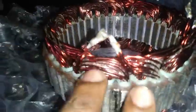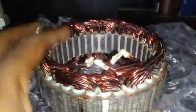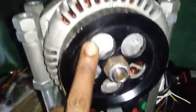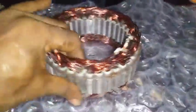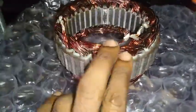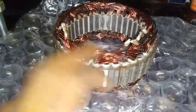If you take a close look, you'll notice we have two wires here, another two here, and another two next to it. So we have six wires on the stator field. Normally you will have three, like we have in this motor. So we have to detect which two wires are the end of each one of these three stator fields.